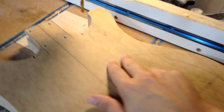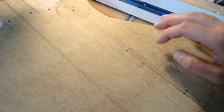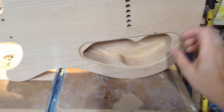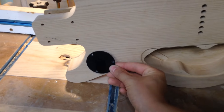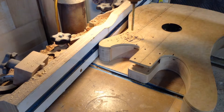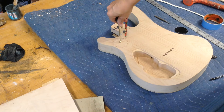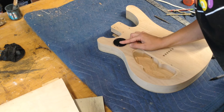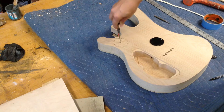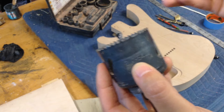We had to move some of the holes that he had put on this template because it was going to hit the edge. I'm moving these over, and this top hole — which I believe is where a potentiometer is going — has to be a backside recess like the one that this came with. That black little plug is going to go over the top of it. The way I'm going to recreate that is by drilling a hole through the whole piece where it needs to go. That hole is what I'll use for my hole saw to guide it in place. I could take a compass and mark the inner lip, because this black piece needs an inner lip to sit on, and then mark a little bit inside for the depth.